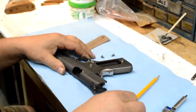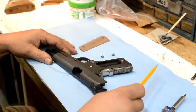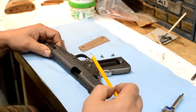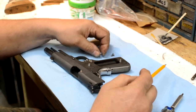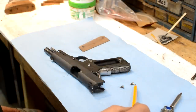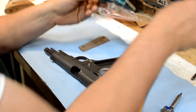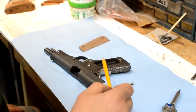If your grip screws cause this bushing to thread out, it's going to come out of a 0.235 by 60 hole. I'm not taking the grip bushings out of Frankenstein just to demonstrate how they can be screwed up. But a 60 thread per inch fastener can be cross-threaded in a heartbeat. So the number one thing I want you guys to remember about this: these screws should have a very, very, very light coating of molybdenum on them. Do not, under any circumstances, Loctite these things in, and you don't have to crank them down. Run them down till the grips stay snug.